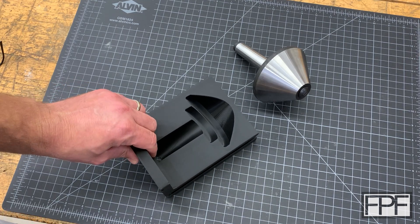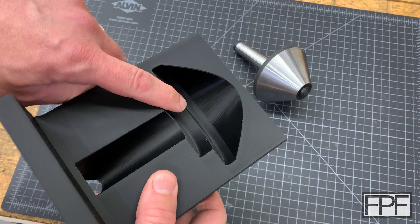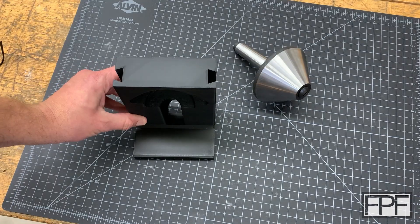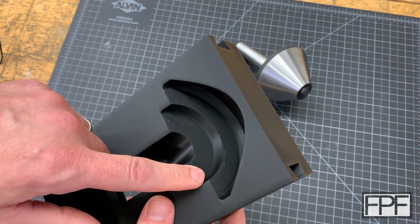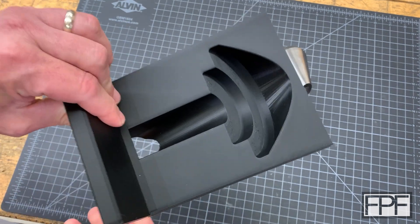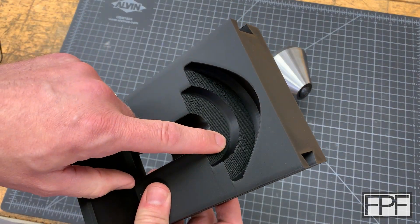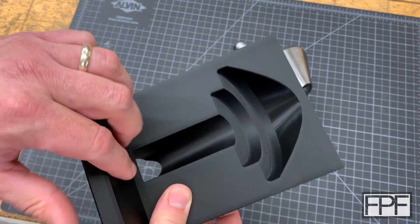Our test piece is completed and it came out pretty nice. One thing I noticed is the surface finish down here is pretty rough in places and super nice up here — this is actually our overhang area. This printed standing up like this. I think what happened is I just did not have enough density on the infill and not enough top layers. This was done at very draft quality — I just wanted to get it out quickly to see if we were close with the shape. For the final print I need to crank up the infill and add a couple extra top layers.